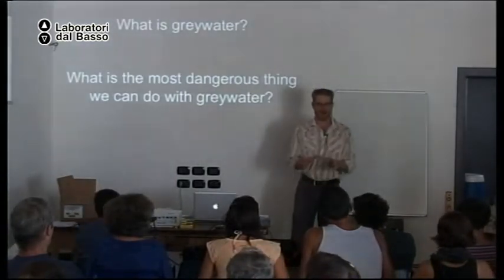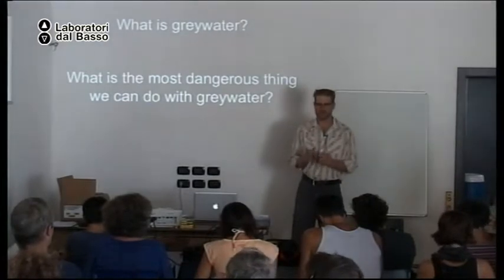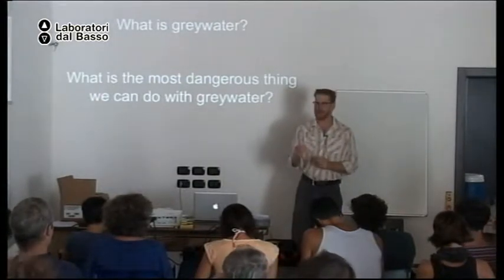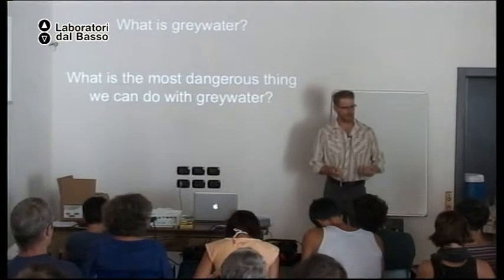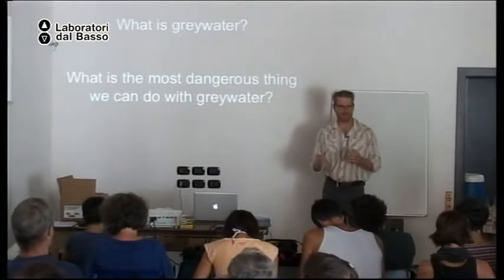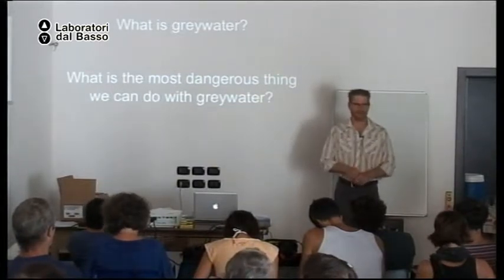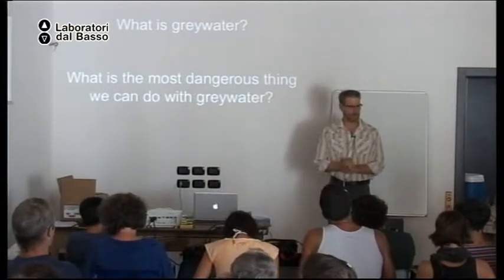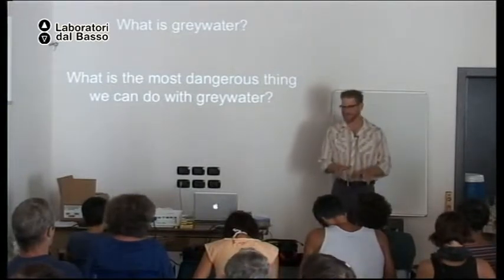Now, kitchen sink water. Many health agencies consider that to be black water as well, because it has lots of organic matter in it. And there is salmonella coming out of the drain from kitchen sink water. But you can harvest kitchen sink water like you harvest gray water. It's possible. I do it. But the law might not allow it in your area. The human law might not allow it. But the natural law allows it.